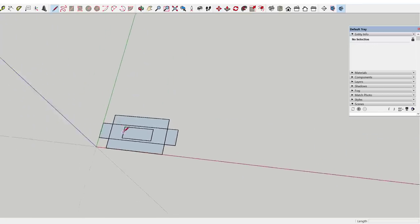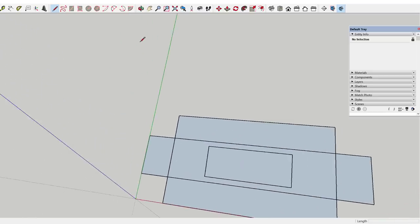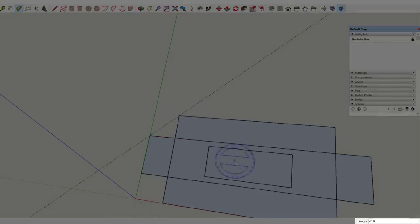And then I'm going to go in here and just verify that the facets on the corners are going to be 45 degrees. And I know that it is because doing math with the dimensions tells me that a 45 degree angle will line up that corner. But if you're questioning your measurements, this step will verify if you were accurate enough. And as you can see, it is.